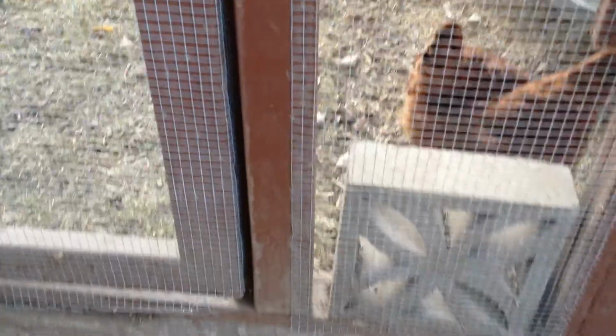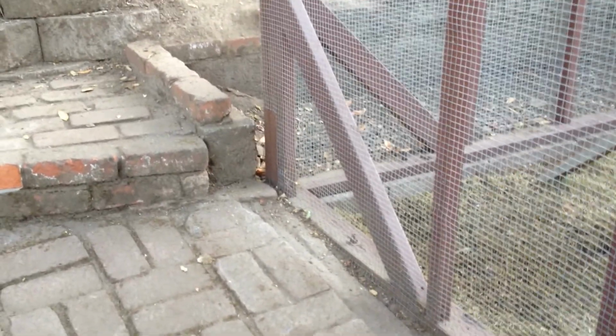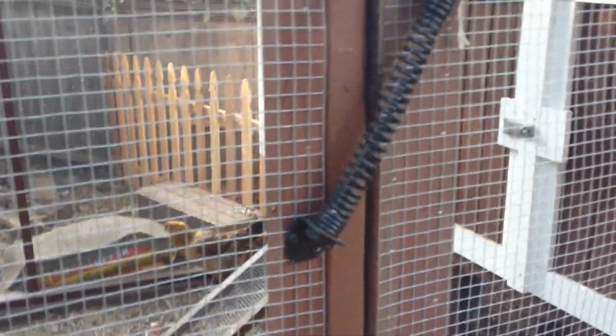So once we got the sill plates in and we got the uprights here, next thing we did was we had to make sure that the corners were upright and level and square and then reinforced. How did you go about doing that? What kind of method did you use? Well, we did these 45s, right? At each corner we cut a board at a 45-degree angle on both ends and braced it at all 4 corners, at the bottoms and the tops. And once it was all level and square, we put the chicken wire on, attached the chicken wire.